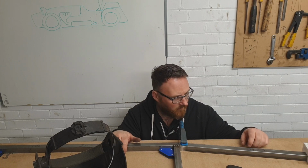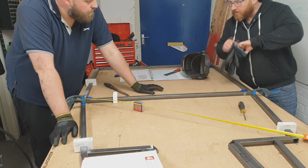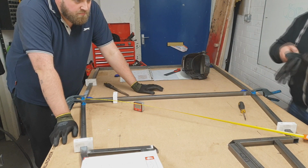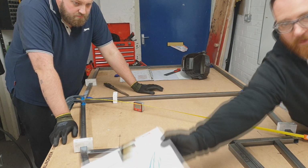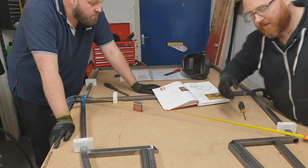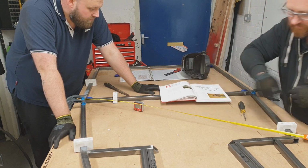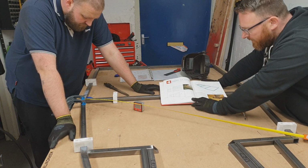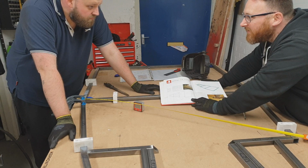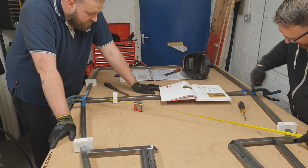If we start having issues down at the front, we'll know why, because obviously that hasn't happened. Fingers crossed. Right, so this is what I mean by fancy measurements. What you need to do, according to this Bible, now we're going back to this guy, as opposed to sticking with the other big Bible we're using, because this one helpfully has the cross section, the cross diameter measurements. The diagonal measurements. It tells you what this measurement needs to be before you weld this up.